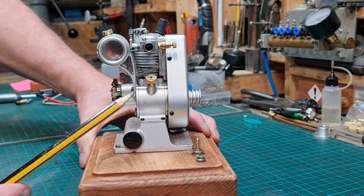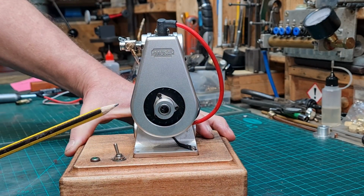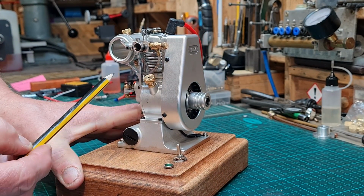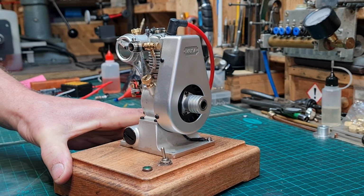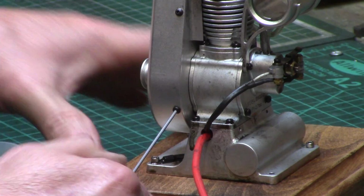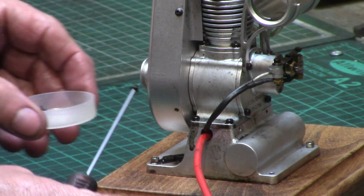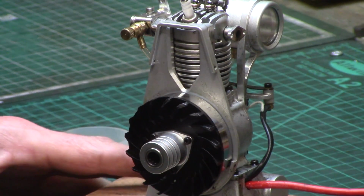The engine is equipped with forced air cooling, similar to the lawnmowers, via the internal centrifugal fan on the main drive shaft. This forcefully blows air across the cylinder body through the machined cooling fins to help keep the engine cool. Removing the cover exposes the centrifugal fan and the engine flywheel behind the cover.